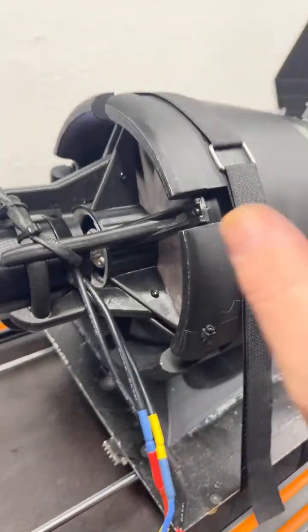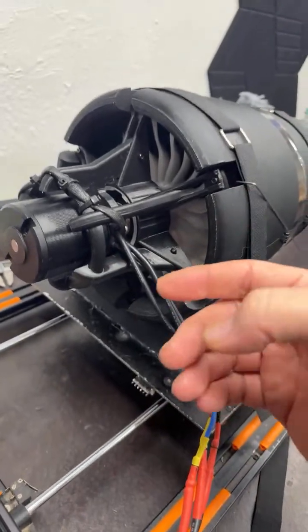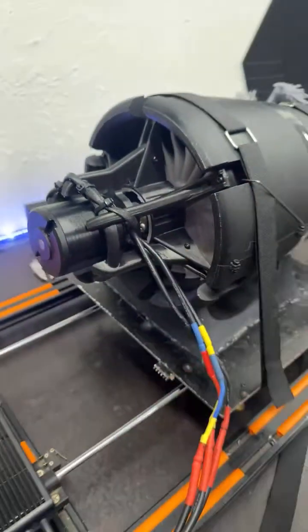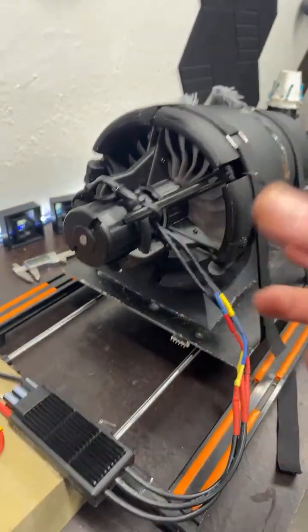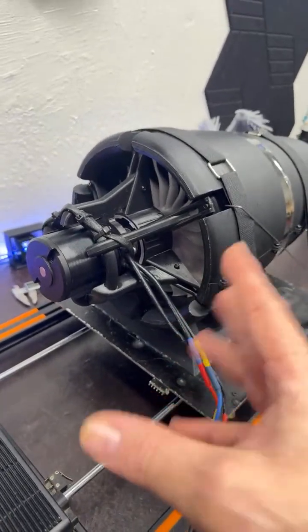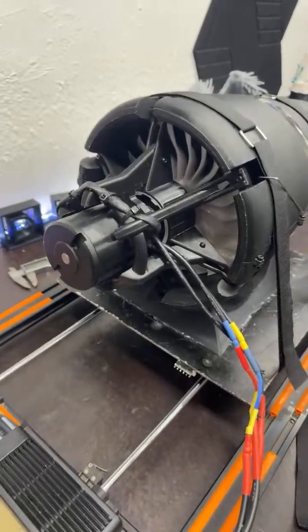So one of the main ideas is aluminum on the planetary. So it's just the Sun gear. So those 4 gears you saw are the ones that I'm doing in aluminum, plus the ring gear that I installed in here is all aluminum. And my fingers are crossed that everything's going to fit perfectly on that one, because that one won't fail. At least if it does strip out the sun gear with the aluminum, then I'm going to have to move everything to tool steel. And that's going to take another 6.5 months to get here.